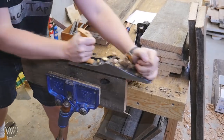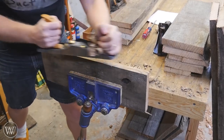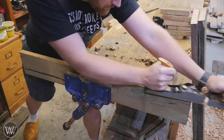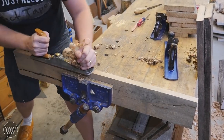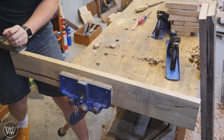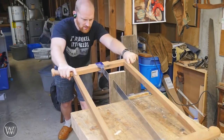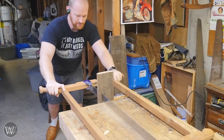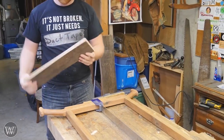You can often pick these up at antique stores. After that, I want to flatten out one edge — joint the edge 90 degrees to the side, nice and smooth, nice and flat all the way across. This will give me an edge I can reference so when I go to rip them down to the proper width, I can make my mark off of this edge. Because I don't have a saw bench yet, I'm going to be using my frame saw. I love how fast this marches through that white oak — it's just fantastic for ripping. I might do this occasionally even after I finish the bench.